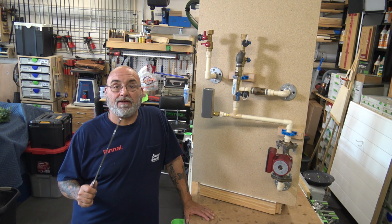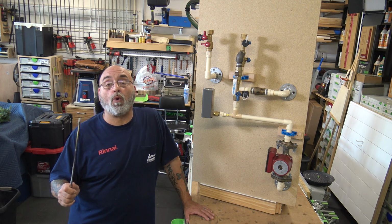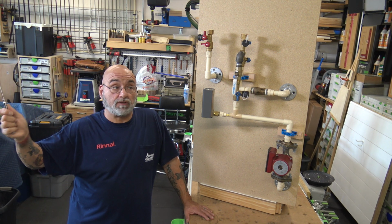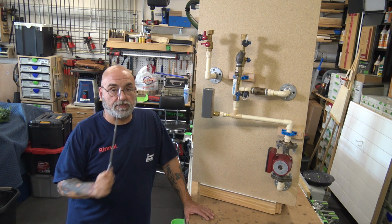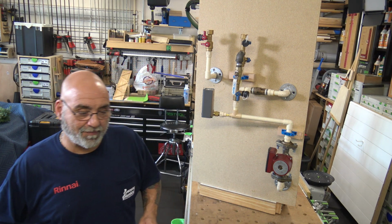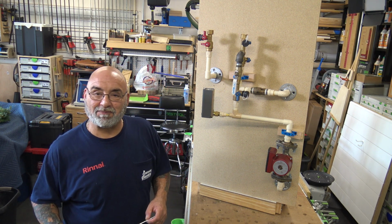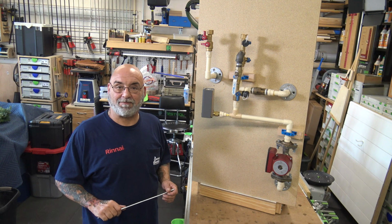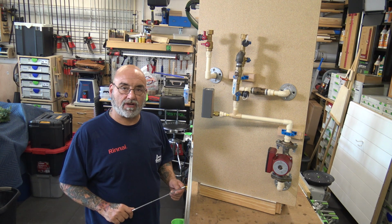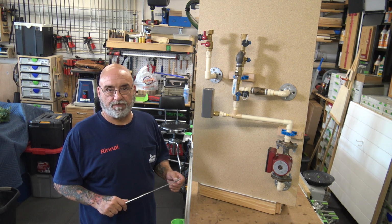Now, on big applications that we put tankless units in, whether it's multiple tankless units or the Demand Duos that have 2, 3, 4 circulating pumps going from different parts of the building, we will use this. But on a normal home, let me just step back one second. I can't tell you the last time that I installed one of these pumps because of the RUR unit. If I go in and it's a large home and it has a recirc, I'm selling them and installing an RUR. There's really no question.